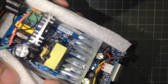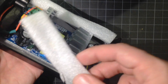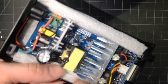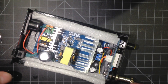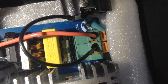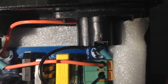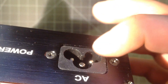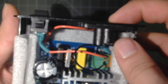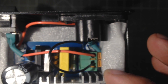The power supply is pretty decent, but it has sort of pokey solder connections at the bottom. So I've wrapped it in the foam that it actually came in from Banggood — if you buy things from Banggood, they ship things wrapped in this foam. I just put a layer underneath and on both sides. For the power connections, they have terminal blocks here. I have wired the AC input in series with this switch.